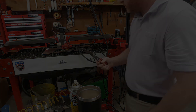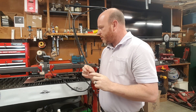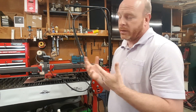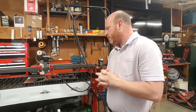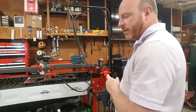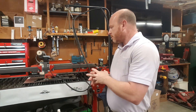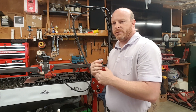I've got to tweak some of the lead-in and a little bit of the speeds, but other than that we're back in business. That's it for the actual rebuild. I've got a couple little things to do to get it closer to perfect — it'll never be 100% perfect between my lack of knowledge, but it'll be very, very close. The machine is capable, Linux CNC is capable, the controller is good to go. I just need to learn a little bit more, work with it more, get more comfortable. I need to add an e-stop, some limit switches, and familiarize myself with Linux CNC a bit better.